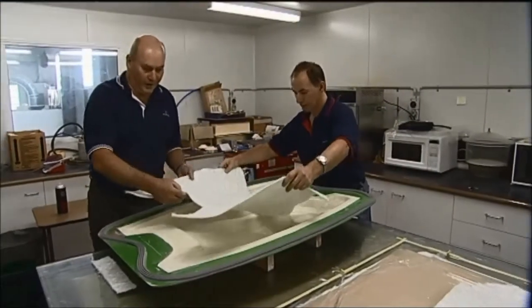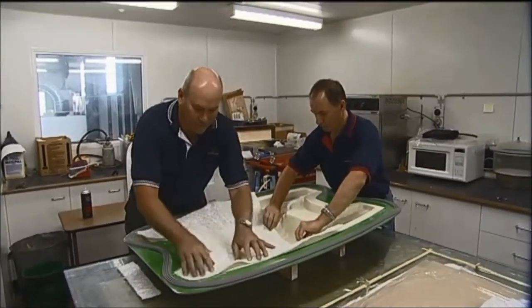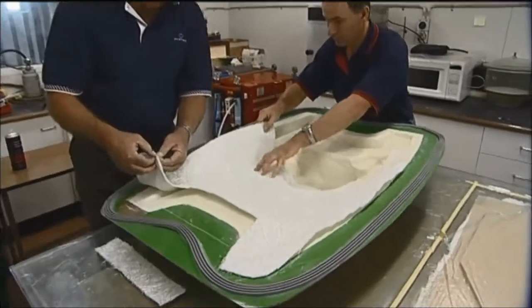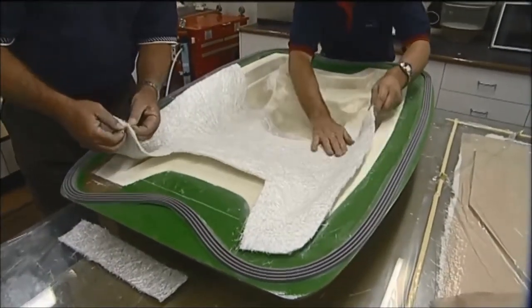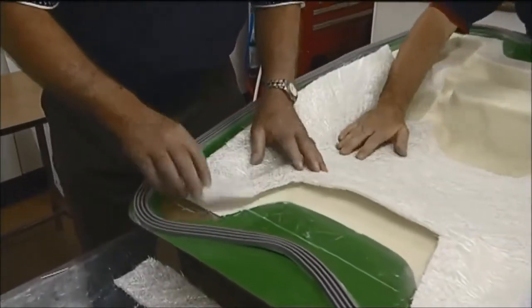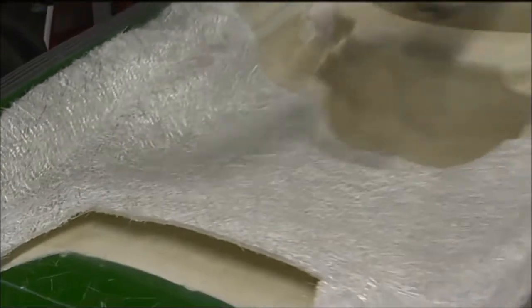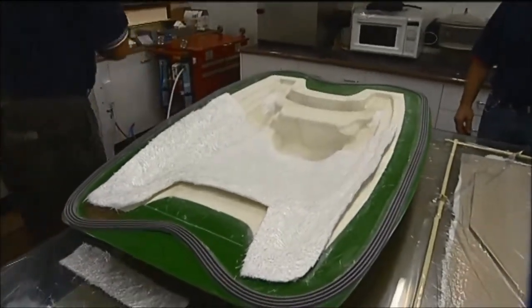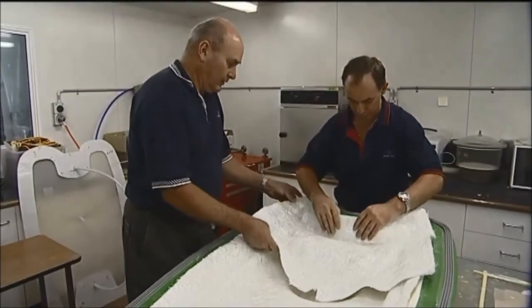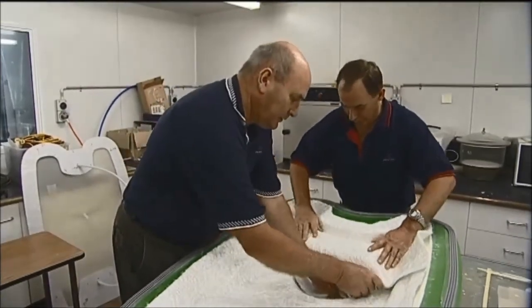What we'll do is load this part up with a reinforcement that acts as a transfer medium. A light resin coat is sprayed before placing the reinforcements in the mould cavity. The reinforcement, consisting of carefully tailored woven roving, cloth and/or mat, is laid in position dry onto the mould. In this case, it is placed on a gel-coated mould.